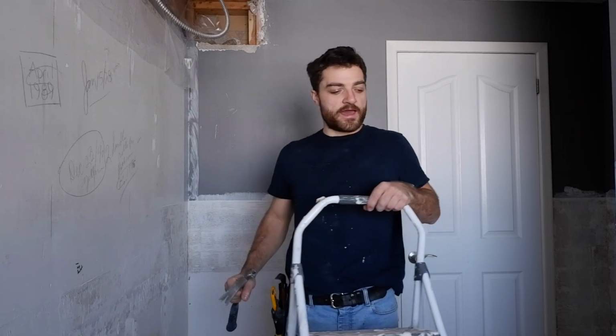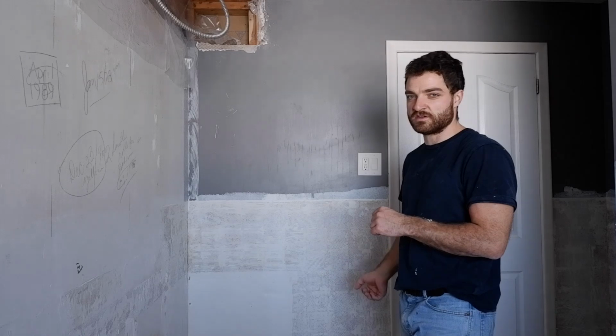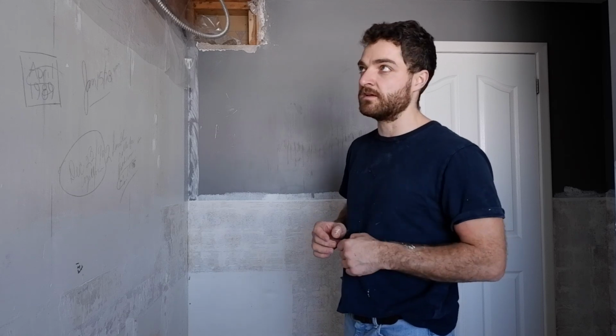Okay, the primer is dry on the walls, so we can go ahead and mix up our sheetrock 90. And I'm thinking it will take at least 2 coats, most likely 3 coats, to get it smooth and finished. We'll do the first coat in sheetrock 90, and then we might use a low dust pre-mixed mud compound, just because you can apply it a little thinner, you can pull it a little tighter, and it's a bit of a better finish than I can do with the sheetrock 90 light. But we can go ahead and mix that first batch up.